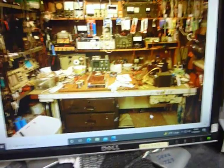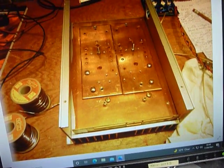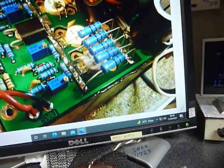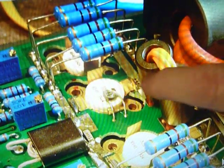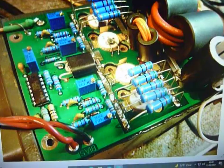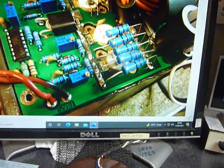The problems I had were with the 723 voltage regulator drifting. And all chip capacitors — right there, right down in there — those things blew about the third or fourth time I ran some power through this amplifier at a higher level. They just popped. I replaced them with four standard 0.05 μF disk capacitors at 1000 volts.